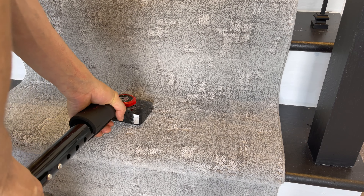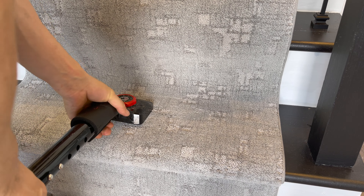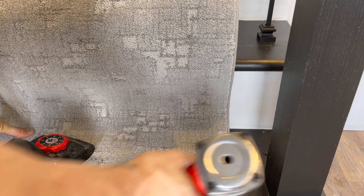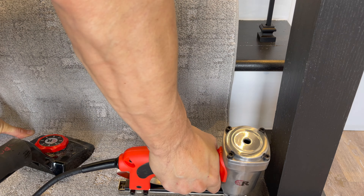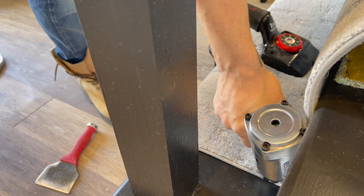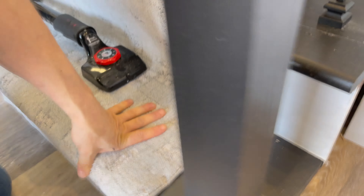We want to get this right in the center. Let's put some tension on that — this is nice and tight. We're going to put some tension on this. The more tension, the tighter the stairs are going to be. So we're going to pop a staple in over here, hold it into place, staple over there, staple over there. Put some tension, staple over here, staple over here, staple over here. When we're doing our staples, we try to keep those indentations out. If the indentations are bothering you, you can hit them down with a hammer. We like to try to keep them between that line and the binding because it doesn't show as much.